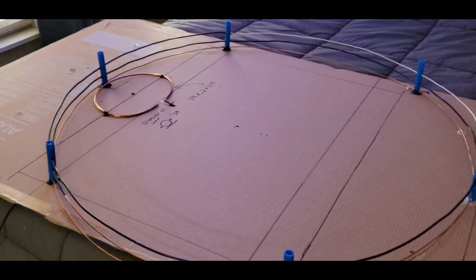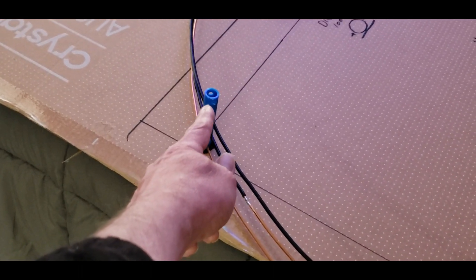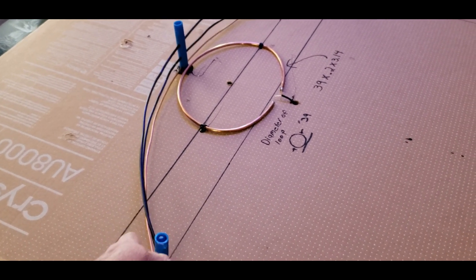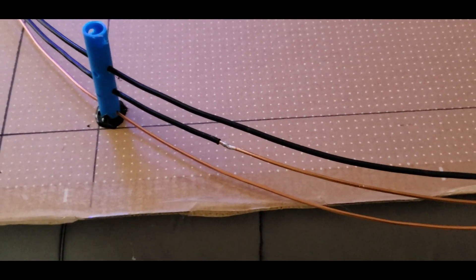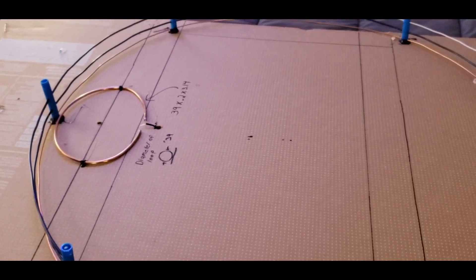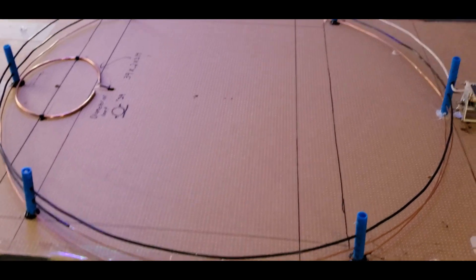Cheap and easy to make, and it's multi-band. Think about investing in one of these. The PEX pipe in a 10-foot length was about $2. I got the wire for free, but if you have to buy it, just buy Romex house wire, cut the sheathing off, and use the conductors. You can solder different lengths together or just use one whole piece. A razor knife to cut slits in the PEX pipe and you don't really need any extra tools.